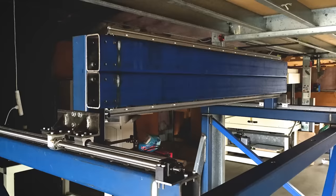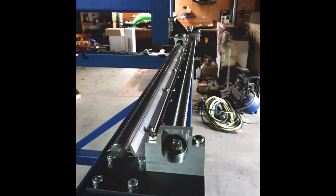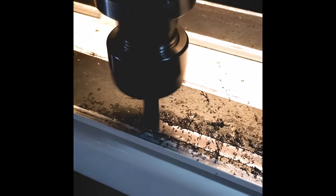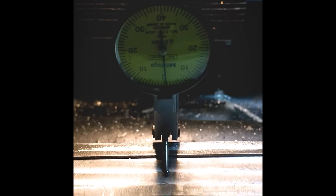But the gantry was not really as good. It should have been more of a square shape instead of a tall sort of shape. It's 250x75 thick — it should have just been 250x250 — because the torsional rigidity is not great with that long Z axis as it sort of twists it. The linear guides I used were not really up to the task either: they were the wrong type and too small, but that was really just a budget constraint. I later changed the Z axis so it had some nice box-shaped linear guides, but that really just revealed that the gantry was the problem and not the Z axis.